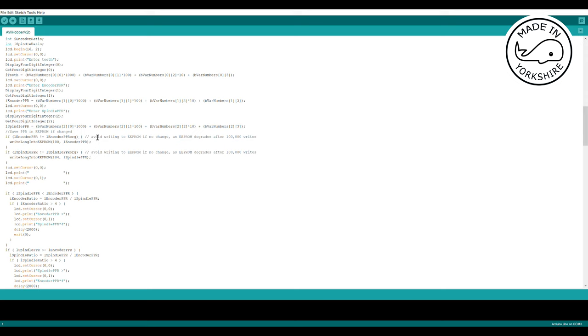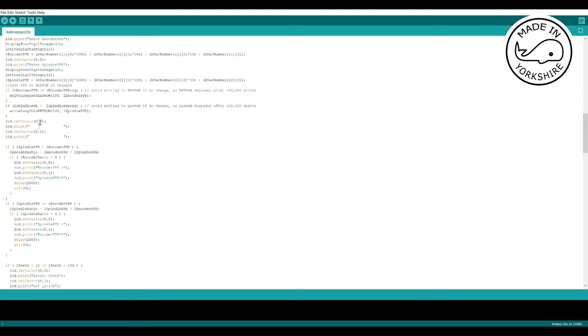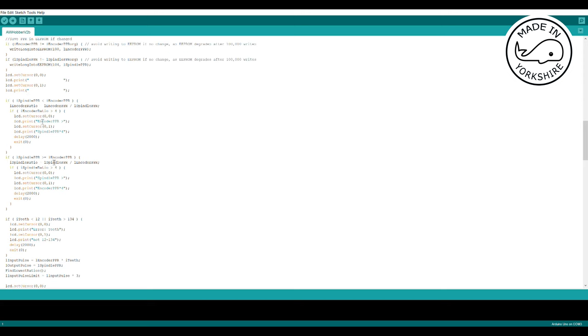I don't want to write it if it hasn't changed, because EEPROM has a limited number of writes before it starts degrading. I think 100,000 writes, which is quite a long way off, to be honest. Anyway, having done that, I do some various checks,